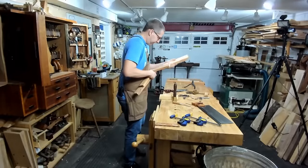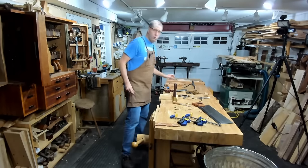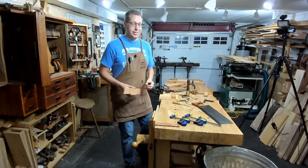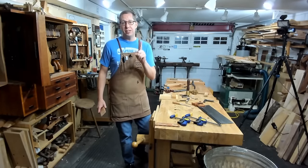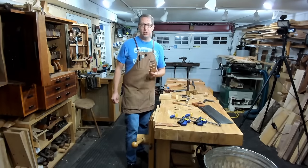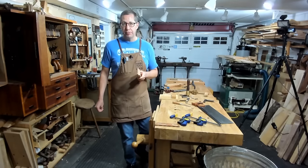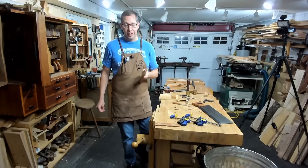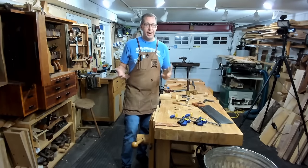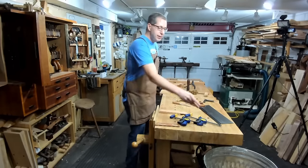The whole craziness of cutting these joints — who knows what those angles are? And that's the beauty of it: I don't have to set a compound miter gauge or any of that stuff. I just have to — principle one — see the line to saw to that line. When you get these weird twisted angles, if you're trying to muscle that saw, or you're using a saw that's not quite appropriate, you're going to have trouble. Principle number two: let the saw do the work. And then most importantly, maintain that single geometric plane. Those three things come up in every single cut you make.